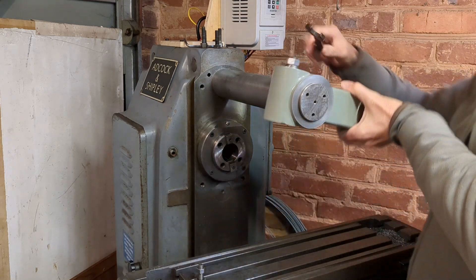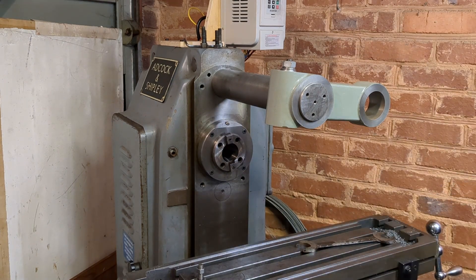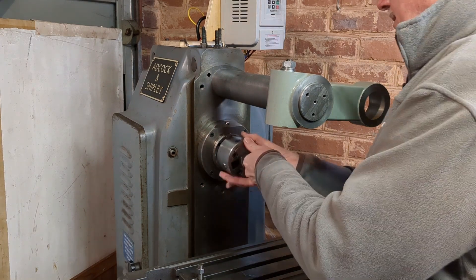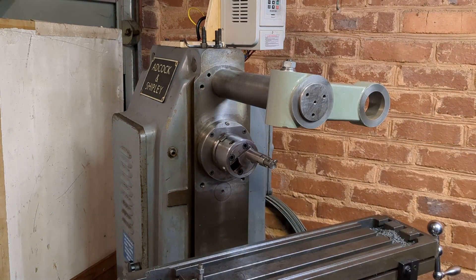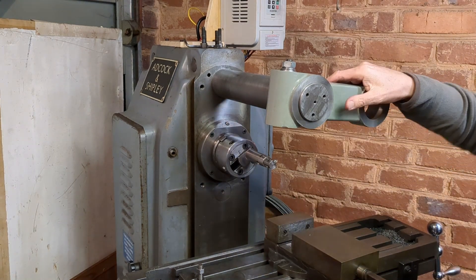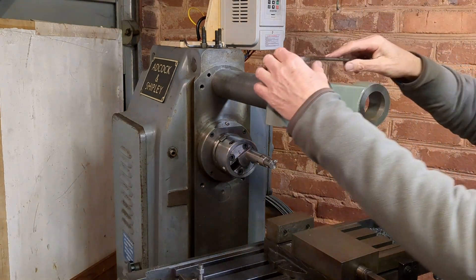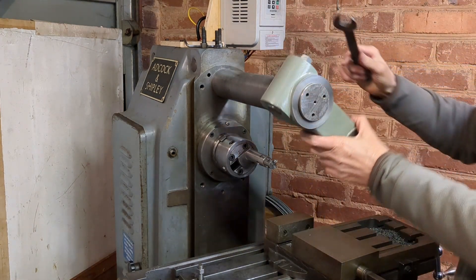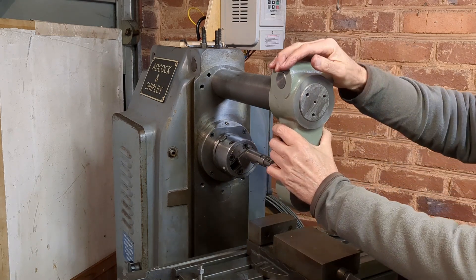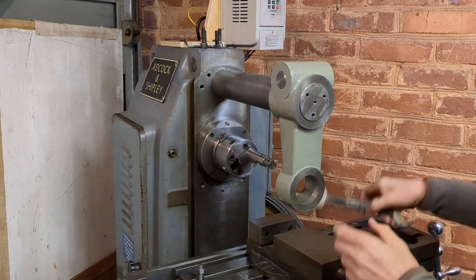I'm just getting set up here for what I hope is the final operation on making this bracket, so I'm refitting the boring head — that was a really good buy and I've used it a lot in this project. The plan of action is to use my smaller vise to grip the lower part of the casting, with the casting cottered securely to the bar to allow the bar to slip through the head. There were some assumptions made here — in particular that the travel on the table was square with the bar itself. I already knew that the centre line of the machine was, but I wasn't sure about the table.